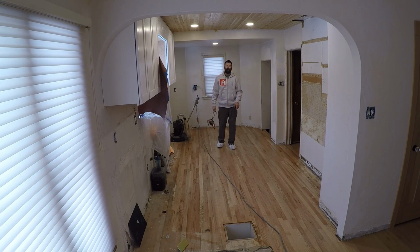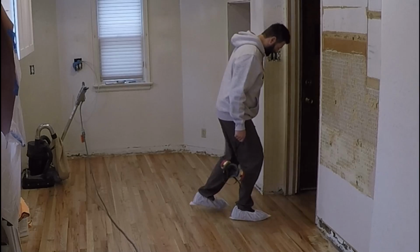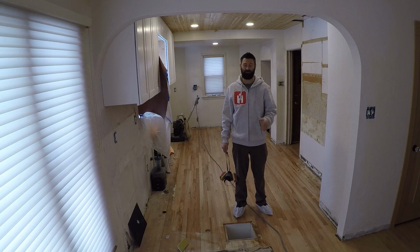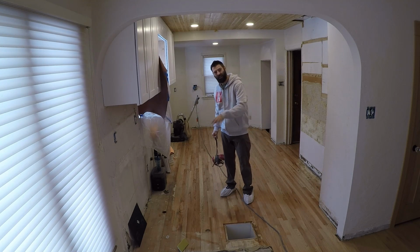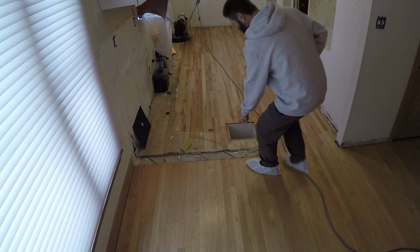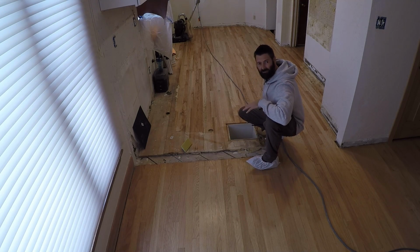Yeah, right there. I'm going to have a video on this floor squeak. It's been asked hundreds of times: are you going to show how you fix that floor squeak? Got one here. Some here. And I think might be another one around here. Now, you're never going to fix it, well, you could, if you were determined. These old houses, they did not glue down the subfloor. It's actually diagonal planks, not sheets of plywood. If you look right down here, you can see what I'm talking about. This here is the subfloor, and it's all just hammer and nail. A hammer, not even a nail gun. No glue, so you're going to have squeaks.